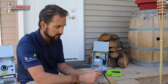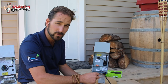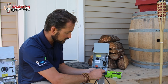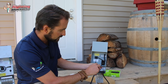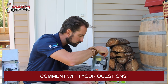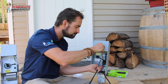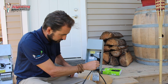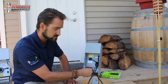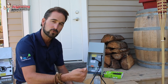I've got my 12-2 wire split. All I have to do is wire that into the terminals. There's no polarity, so it doesn't matter how you wire them in the field. As long as each terminal and every light has two wires going to it, you're not going to have a problem. Back these screws off and push your wires up into those terminals — one in the common tap, tighten that down, and one in the 15-volt tap, tighten that down. Now you're basically good to go and can test your lights. This transformer just has a simple on-off switch, but I'm going to show you how to control it with either a photocell or a smart timer.